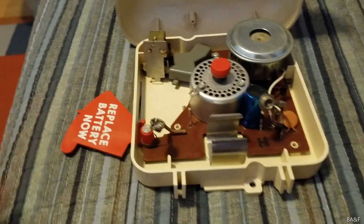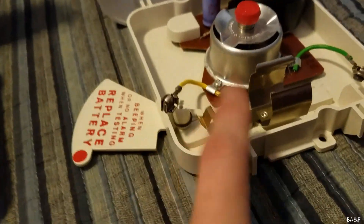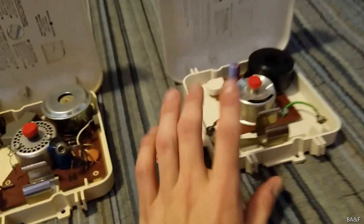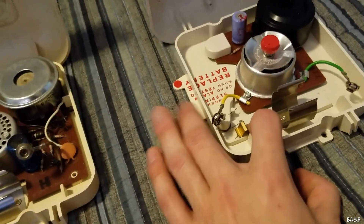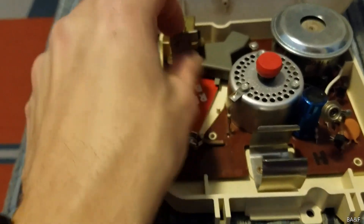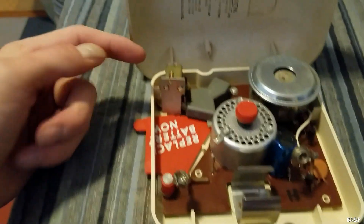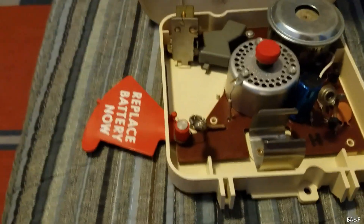You're probably wondering what that little mechanism is over here — that's the mechanism that triggers the low battery flag. This is the 8201-201, and this is the 101; this one immediately succeeded this one. On the 201, the battery flag is simply held in by the battery clip — when there's a battery in there the flag is held in, and when you remove the battery the flag flips out. This 101 is a great deal more complex. There's a small silver box that's actually an electromagnet, almost like a solenoid. When the battery runs low and the horn chirps, it sends a pulse of electricity to this electromagnet and triggers it briefly so that the spring-loaded battery flag flips out.